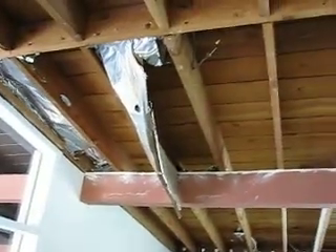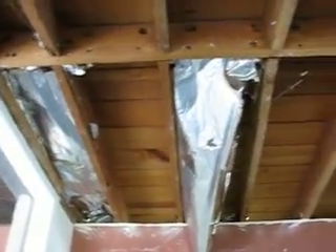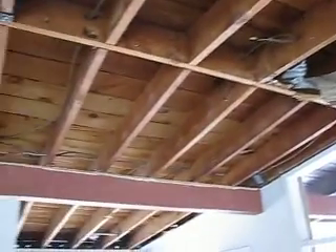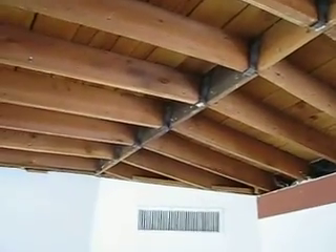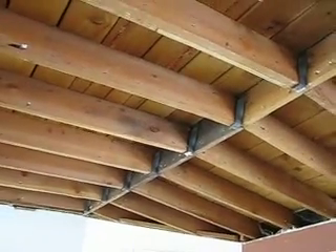The house really didn't have any decent insulation in it. This little bit of foil radiant barrier was the biggest part of what it had. Even on top of this, there was a fair amount of gravel on top of the foil barrier — probably from when the home was originally built with a stone covering on the roof. A number of homes had that at that time on this model, and then it got changed out over a period of years.